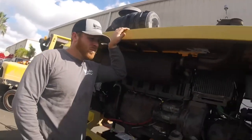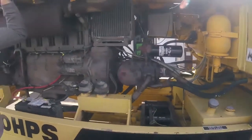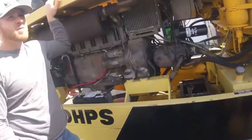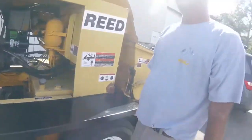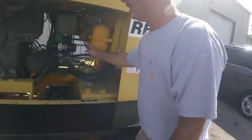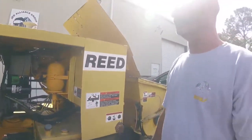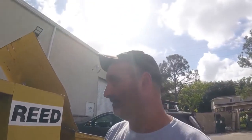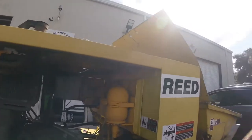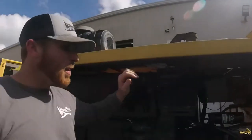So this is two, that's why it has that. Dual circuit. So this thing is filled up with 100 bar of dry nitrogen, and then the pump accommodates the other 100 bar, and that gives you 200 bar. So it shifts fluid probably down and right back up. Now the pump doesn't put that 200 bar for very long. They're different pumps, and they don't accommodate the heat. So if this thing gets low, the pump tries to accommodate the lowness, and you end up burning the pump up. So what do I buy to put in this?